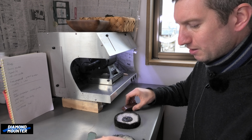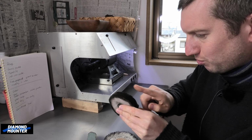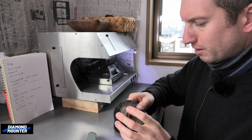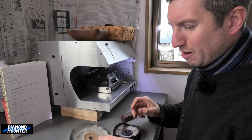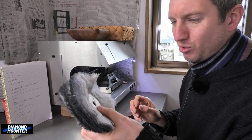They are specific. And then even the mops as well, you can see I've written on them, I've got red in or green in. That way I can just grab it without having to closely look at which way they're pointing. I want that side goes inside every time. That's quite important. When you share a workshop, when you work with other jewelers, other people will grab your mops and just put them on any way they want, and it used to really wind me up to the point where I bought my own mop for doing platinum.